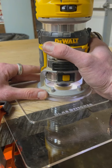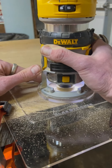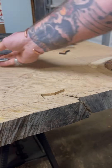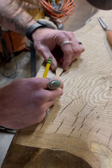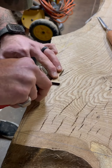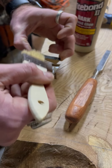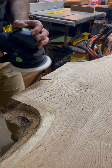Nice shot of it there. I had my local lumber mill go ahead and flatten and straight-line rip one side of this slab for me. I just don't have the capabilities or space in my shop to flatten an 11-foot slab without building a sled, and I like supporting those guys — they gave me a pretty good price. Being about 30 inches wide, there were some gnarly cracks and checking. I'll be cutting some of that off for the finished edge, but a little bit of that crack will extend to the edge. These slab stitcher inlay kits are really great to stabilize those kinds of things and deter as much of that movement as possible.